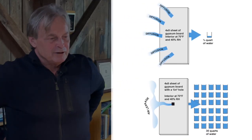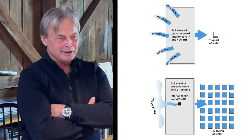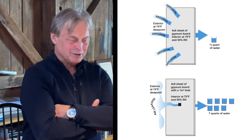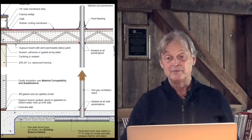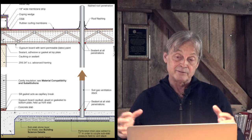Remember the drywall example I took from Madelaine Rousseau, the magnificent genius engineer out of the National Research Council of Canada — we covered Ottawa and Atlanta with that. Going back, Charlie, what should the radon control be? The radon control is real easy: you put a perforated tube in the stones and run it below the slab, below the insulation, and run it internally up through the entire roof structure. You run it internally because you want the heat from the house to create a chimney stack effect. That's how you handle it.